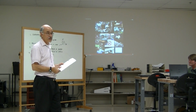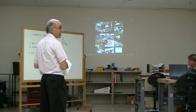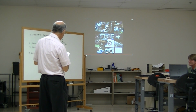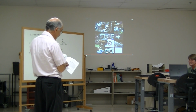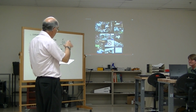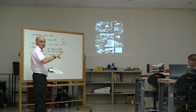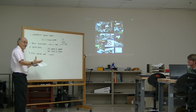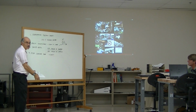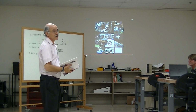So my smaller sheave is going to be rotating at 2,000 RPM. I go to that line and go across until I hit the figure that's higher than 6.5. Over here, that happens to be up here, and that's a 5. So I come down here with my speed, and that tells me what my small sheave diameter is. So in this situation, 6.5 horsepower at 2,000 RPM, I need a 5-inch smaller sheave. Then I multiply that by my drive ratio because you want those two things to be in ratio so you get the right speed. That gives me the size of my larger sheave. If my drive ratio was 2 to 1, then I want my big one to be 10.